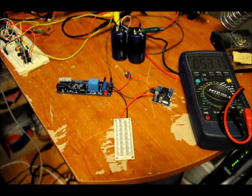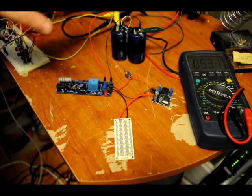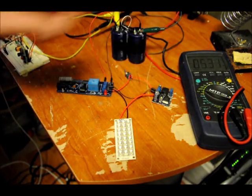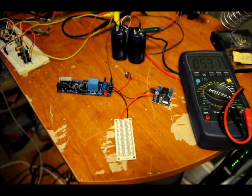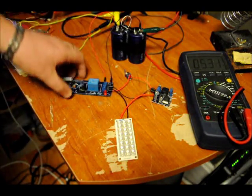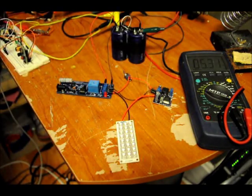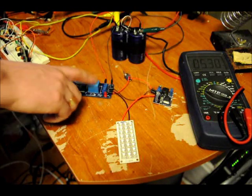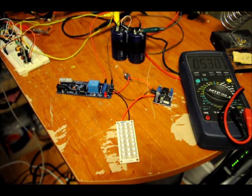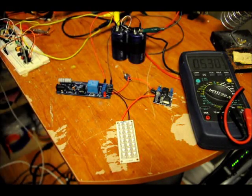That's what makes it special. You build this flashlight and you should never need to replace it — never need to put new batteries in it. If you buy just the kit and you have your own capacitors, your own LED bank or booster, you don't need anything else. You can even go to the dollar store, pick up a dollar store flashlight that has LEDs — not bulbs, they take too much power — and wire it up directly to the output here. I'll offer it with just the board, with the board and two capacitors, or with everything you see here including the switch, the booster, the LED bank, the charge board, and the two 400 farad capacitors. When I list them, which will be very soon, they can be found at engineeringshock.com and electroniclessons.com. ElectronicLessons.com will take you to the eBay store.